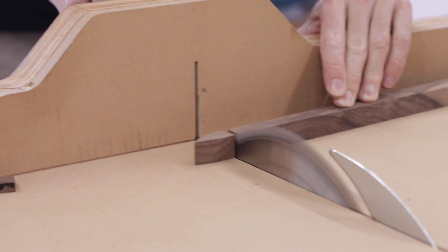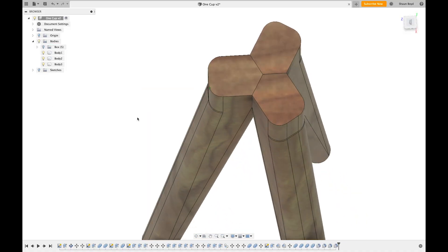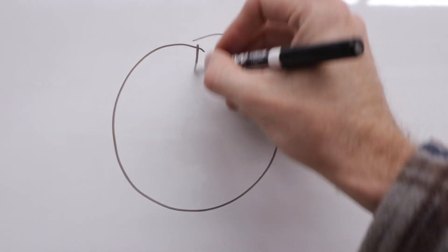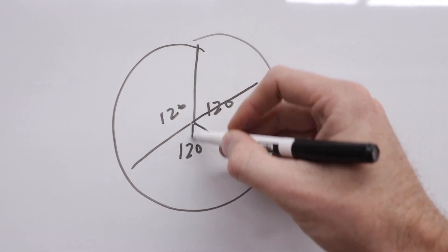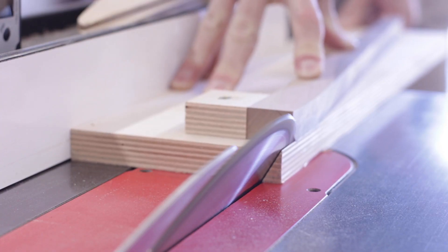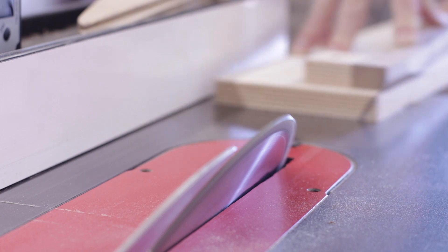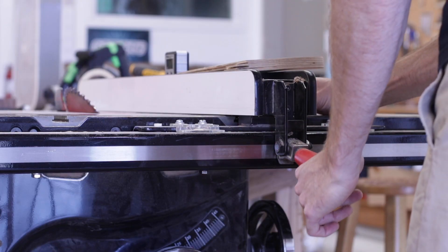With each leg at its finished shape, I could then work on the three-way joint that would bring all the legs together. The math works out to be: a circle is 360 degrees divided by 3 for each leg, which gives us 120 degrees; then that divided by 2 for each half of the joint on each leg, which gives us 60 degrees for each cut. To make these cuts, I first made a sled to cut the first half of each joint on each leg. I'm not trying to nail a specific amount — I just need to make sure I'm cutting just past the halfway point of the width of each leg part, so I slowly move my fence in until I've made that cut just past that halfway mark.